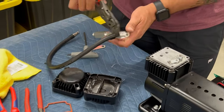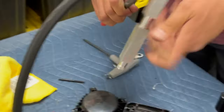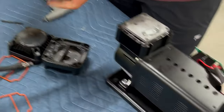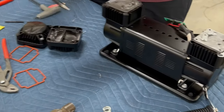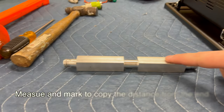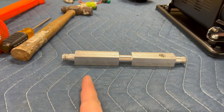This is the interesting part. This is where all the air comes out - from both of the compressor heads - out of this little tiny hole. We're going to compare it to the high-flow fitting, and you'll see why we're doing this mod. Not only are we going to make it automatic with the pressure switch, but the performance is going to increase significantly. Big difference. With the original hole on the top right, you want to drill the new hole on the near left side.